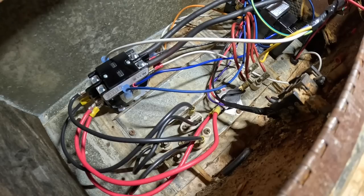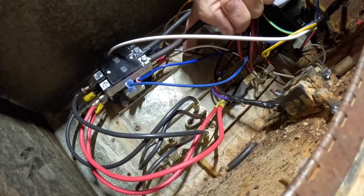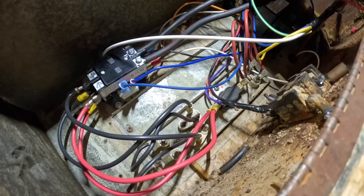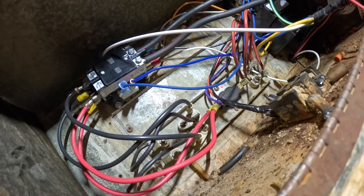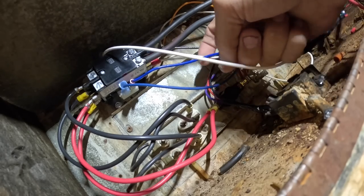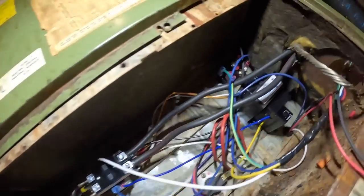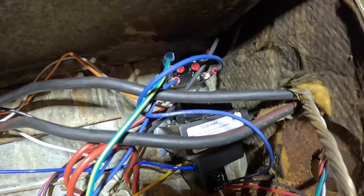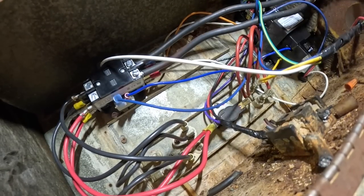All right, now the heat strips will work, but how about the fan? All right, as y'all see, that black wire right there goes over here. That's gonna be my common, and they're feeding blue with it. And this is gonna be my run. It's got power all the time. Over here on the blower relay, that common is broken and closes when there's a call on green.